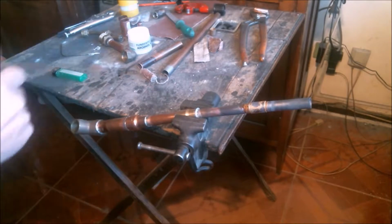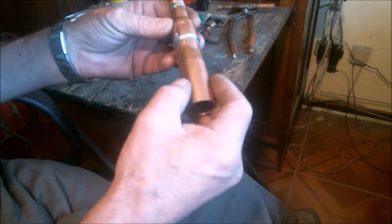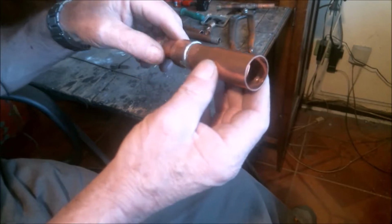However, when working with hard solder, there are some cases when you can braze without flux, but only when you are brazing copper wrought fittings onto copper pipes, like this coupling or this reducer, and using a filler metal that contains phosphorus. But not all hard solders contain phosphorus, and some even contain cadmium, which is a toxic element, and that kind of solder should never be used in homes for water, gas, or HVAC systems.